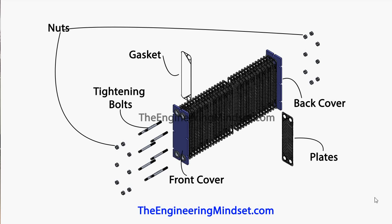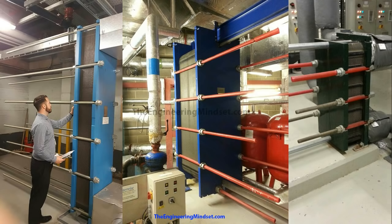Wedged in between, we've got the plates where the heat transfer occurs, and we've also got the gaskets which sit between the plates — that's what gives it the seal. Larger heat exchangers will also have a supporting bar at the top and bottom, and you can see the plates just slide along there. There are various ways they can come off — smaller ones slide in and out, while larger ones drop out through a section removed at the back.